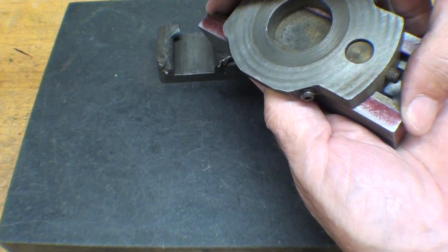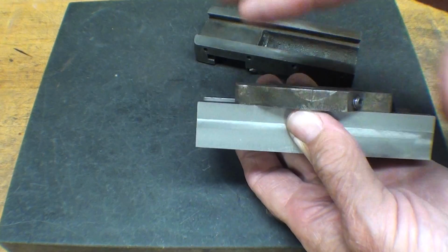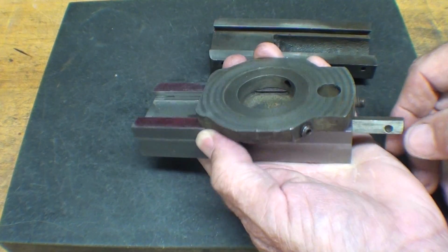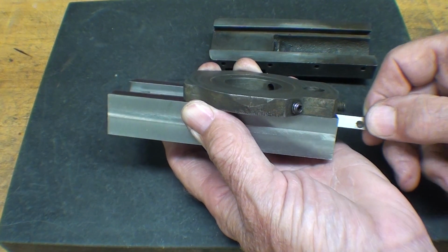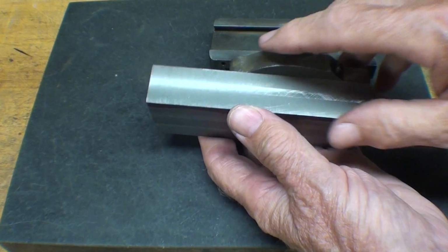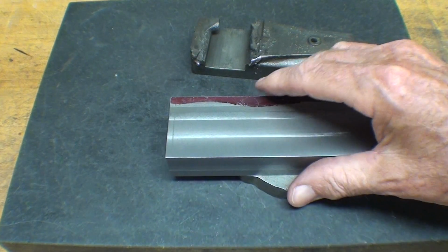There's the gib in place. Now the purpose of the screws here that touch the gib is to not only take up the play, but the screws prevent the gib from sliding out. And the gib screws go into these little holes. So in the next video, next part, I will drill and tap those holes and make the T-slot. So that concludes this video. I'll see you in the next part.